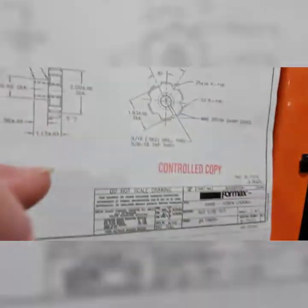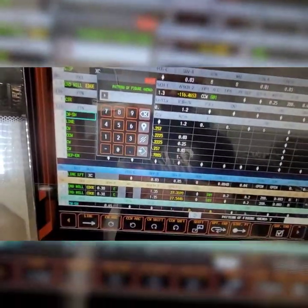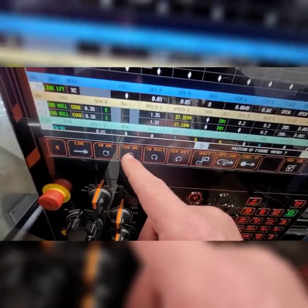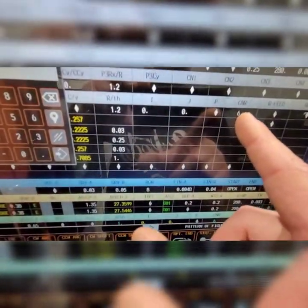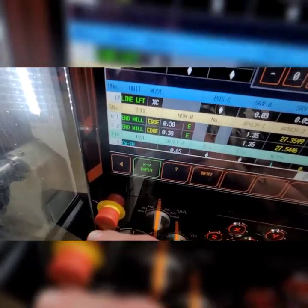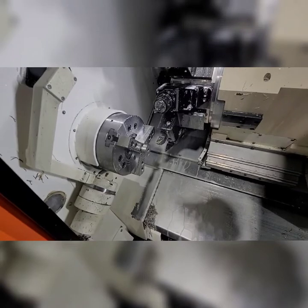So this is how you can program parts like that. Thank you for watching. One more thing — because I was talking about XY coordinates, just in case somebody doesn't know. When you write a program and you go to clockwise shift, that means one section out of 12. Once you get that clockwise shift, it's going to ask you how many times in CNR — number of repeats. On the first line, you press XY input, and that's how you get your XY coordinates. The control translates everything into X and C from the XY coordinates. You just press that and you're good to go.